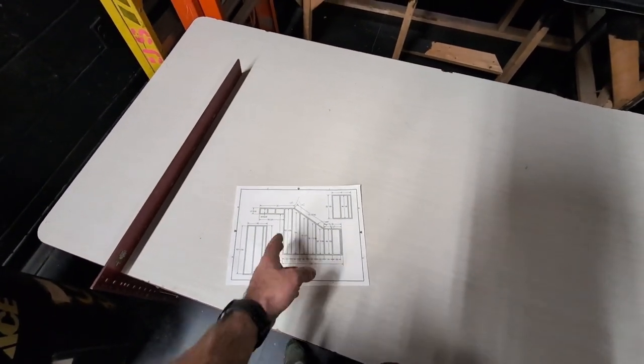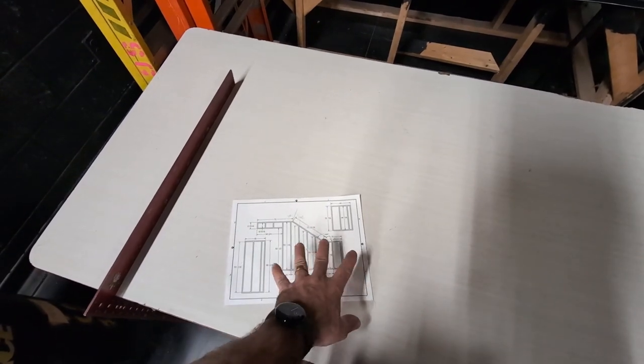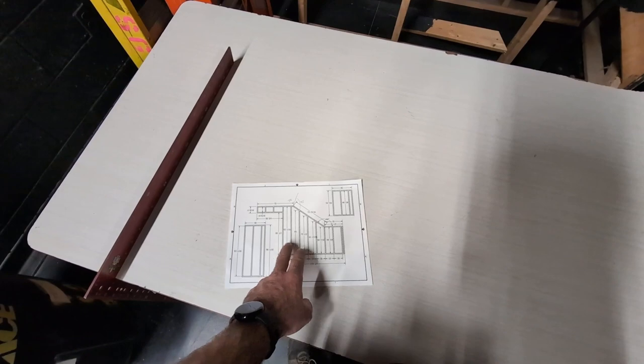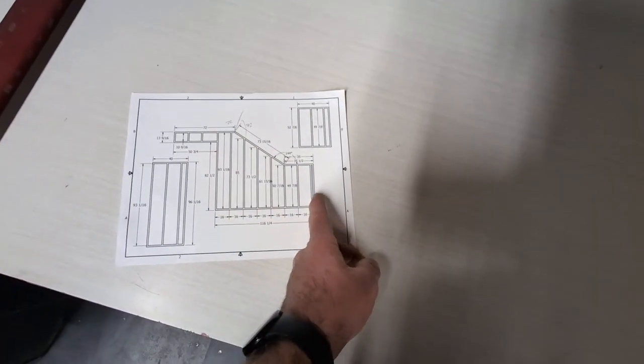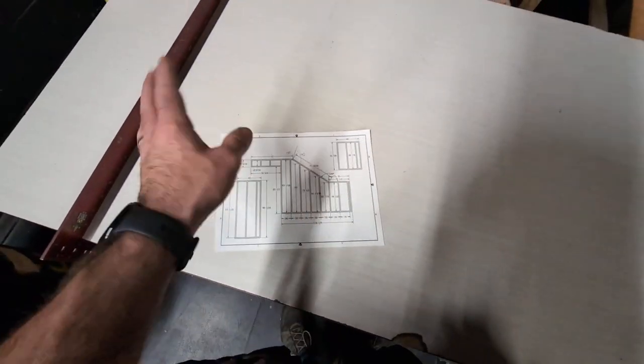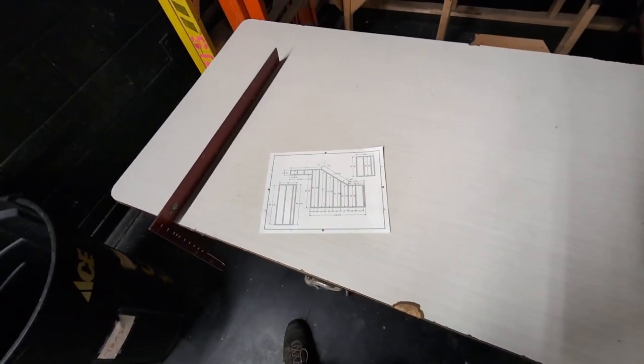as a factor of maintaining a 16 inch layout, but elongating this, I could have repopulated the 16 inch on center layout from this end where we catch it up. And maybe if I started here and went that way, we would have been better off with the layout and stuff, but it's not the end of the world.